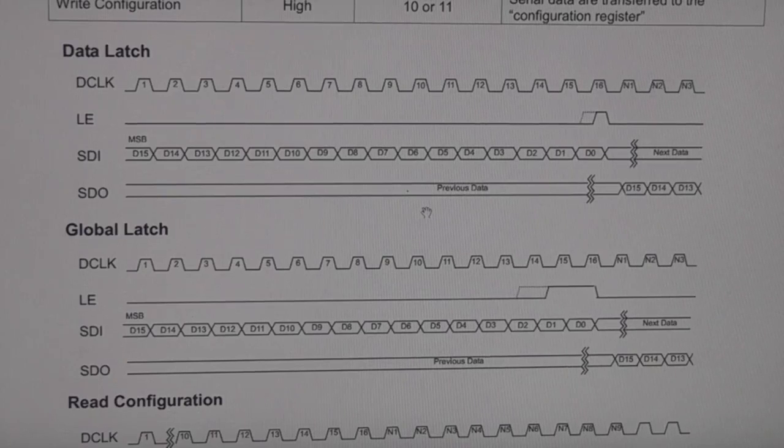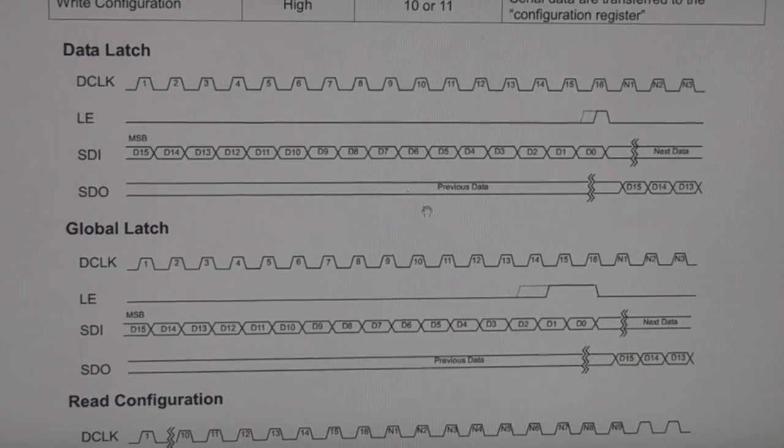Certainly at the small scale. As you go up in scale, the speeds start getting a bit tricky, because if you're using a multiplex display, you have to load each row's worth of data, then display that row, then load the next row and display that. They don't have multi-bank memory or anything, so you end up with quite a high data rate going into them if you've got more than a fairly small number of them.